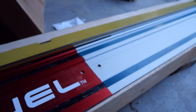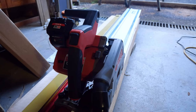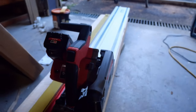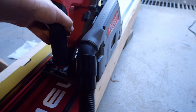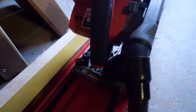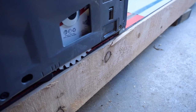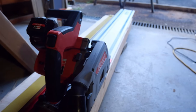I'm going to grab a saw — it's a team effort today. We have the Milwaukee plunge saw with the six-amp high-output battery hooked up to the Makita XGT 40-volt dust extractor. I've been playing with it going over the join and it's a little bit iffy — it pushes the saw around a tiny bit. I've had to loosen off the track tightness on the Milwaukee track so it doesn't jam when it hits the Makita one. I'll cut at full depth — 55 millimeters on this track — with a 40-tooth blade.